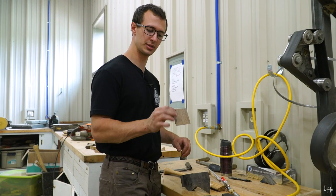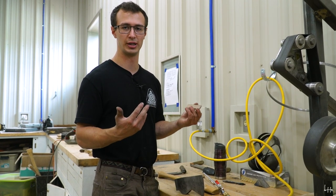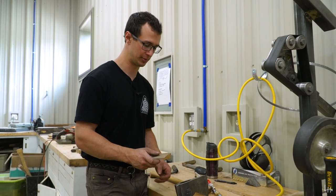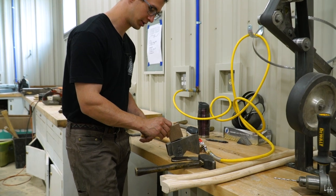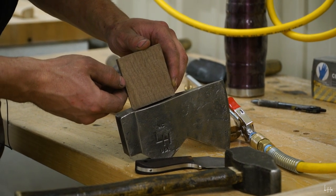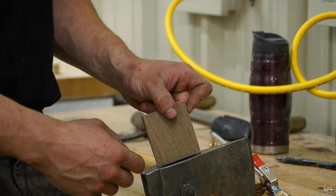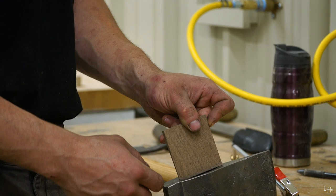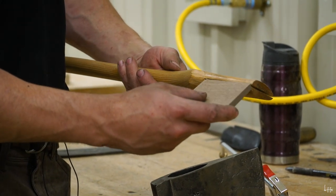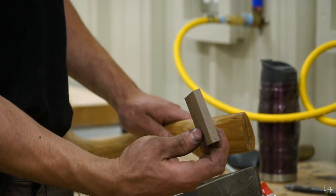The wedges that we send come slightly oversized. This allows you to remove material if you need to, or if your eye is slightly too large, the bigger wider wedge helps fill it up. We put the axe head on a table, take the wedge that comes with this, put it on top, and see how well it fits. You can see here it's about an eighth of an inch too wide, so that needs to be trimmed down. We want it to be the exact size of the eye—not slightly under, not slightly over. It needs to be a tight fit that's exactly the right size. I've also checked to make sure the wedge isn't too long by putting it up to our kerf, and I can see that it's just the right size, so I don't need to make it any shorter or thinner.